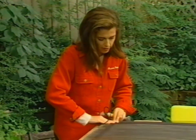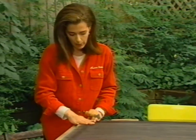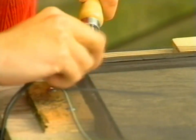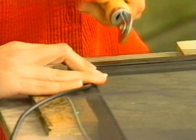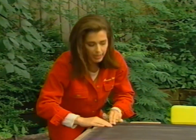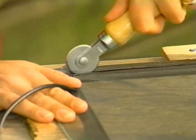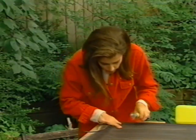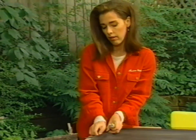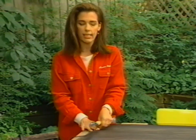Now I'm turning my first corner, so I've got to check that my screen is as flat as possible with no big puckers in it. I'm starting the spline in the new groove and I need to make sure that it's pushed firmly into the corner. Then I'm getting good tension on this new line of screening that I'm about to start to push. I want to be careful to keep pulling the screen but not pull it clear off the other side, so keep your eyes on the big picture as well as focusing on getting a nice line of spline laid in the track.